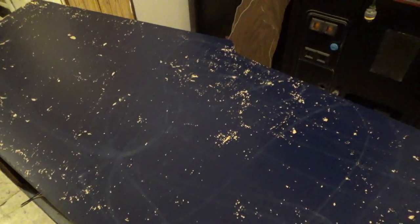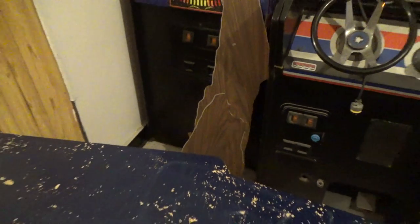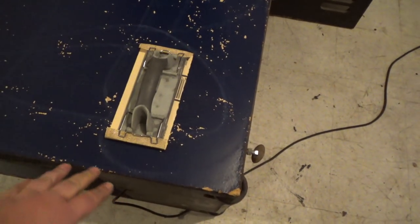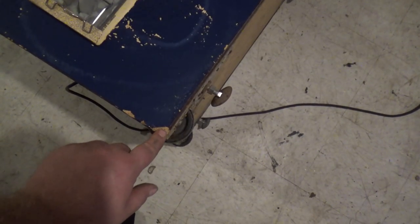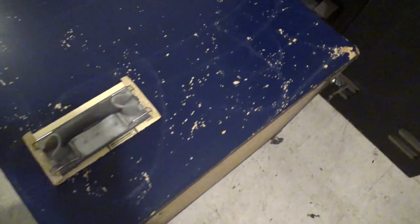I laid the cabinet on its side here. When this Formica was pulled off, I left many, many pockmarks all over this cabinet. So I'm going to fill all this stuff in. But before I do, I'm going to get some 60 grit and sand this entire cabinet down. 60 grit's pretty rough, but I'm going to fill a little divot here and a little nick on the corner with Bondo, and I'm going to fill this here with some Bondo also. I've already removed the T-molding.